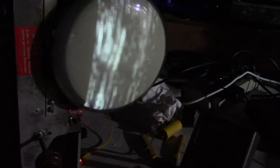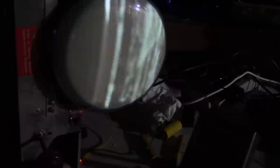Boy, I really can't get this thing to focus. I wonder if that's why they were mucking around. I mean, aside from all the sync issues and all the craziness, I should be able to get that to focus really sharply, and it won't. I'm also wondering if I'm fighting a dirty tuner here, so I'm going to change channels. We're even here just on an empty raster, you know, no reception. I wonder if this focus control might be shot. It's doing something, but not as much as it should.